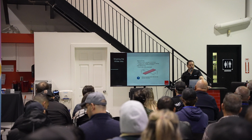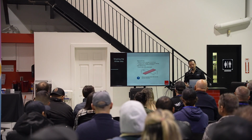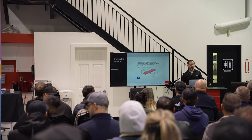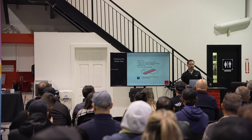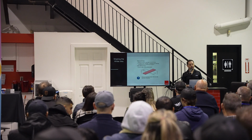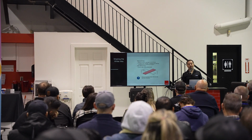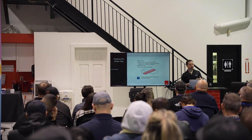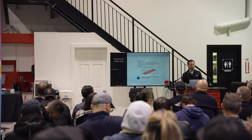Continue on. So another important feature is I did say we have a circulation technology. The machine, typically once a day, will tell you to shake the white ink cartridges. So basically you can pull out the cartridge, shake it, and here it says once a week now. You're doing it daily, and it says if you haven't shaken it for more than 3 days, 100 times. So you want to be doing it daily. It'll tell you when to do it, and that basically stops the separation from the titanium-based liquid inside.